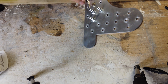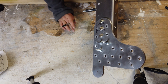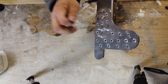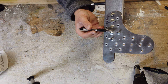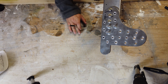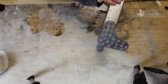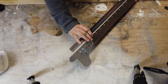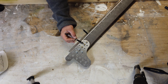I have long bolts with nuts here because I did not want to buy number six clecos for A6 rivets — I just can't afford that right now. So I used some long 3/16 bolts with little nuts, got a triangle going so this thing doesn't move, put my bolts in starting from the middle working outward. These are AN3-5 alpha bolts: 20 to 25 inch-pounds. If you have drag — meaning your wrench is starting to move — add three pounds. Your 3/16-inch washer goes on the inside; the washer then the nut. Someone on the forums said to put the washer on the other side — don't do that.